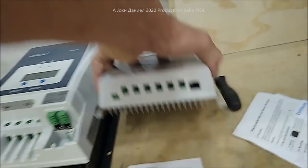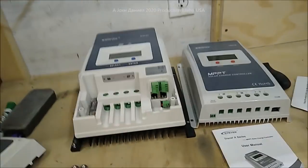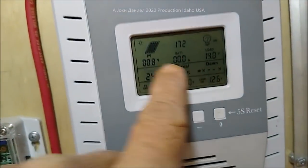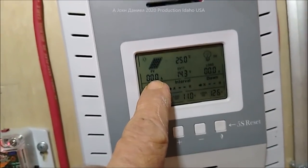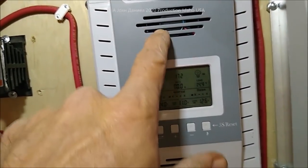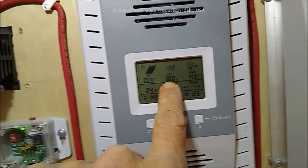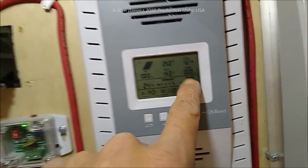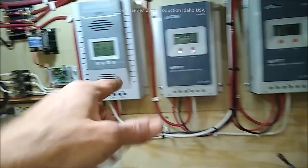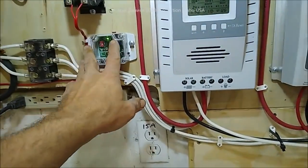Let me get it mounted. The process is going to be simple — there's no sun, no power coming in right now. We just have a presence voltage on the panels. Voltage is 14.3 from my 14.4. And over here — by the time the power gets down this DC cable and gets a reading over here — setting this one at 14.5 volts, it works perfect for my diversion load.